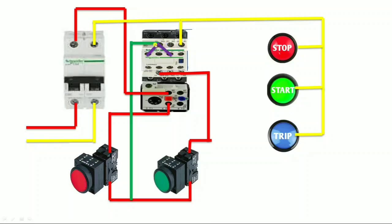We can connect any supply — from NC output, NO input, or overload relay. Since we already have holding supply here, we connect looping from one NC and one NO. First understand stop indicator wiring. When the contactor is in stop condition, NC supply comes here directly. So we connect one looping from the NC terminal and give it to the stop indicator. When the contactor is in stop condition, NC supply comes directly and operates the stop indicator — when our starter stops, the stop indicator glows.